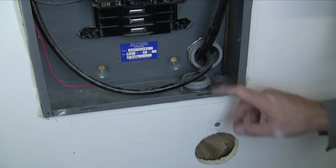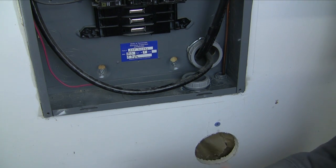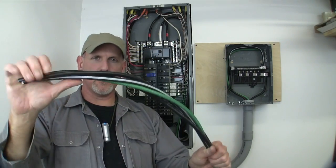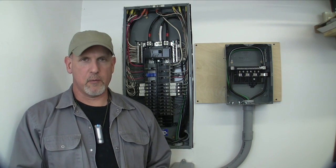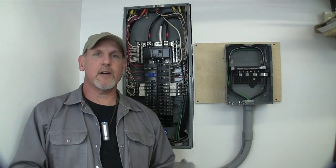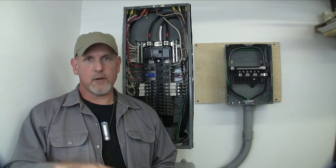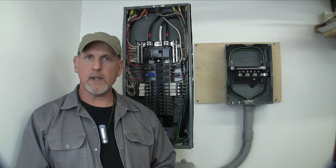So that's what we end up with. I'm going to attach this box to the wall, start pulling the rest of the conduit, get everything situated, and we'll be ready to pull the wire. Now the wire I'm using for this sub-panel is number two aluminum wire — and just hush, I don't want to hear it. People use aluminum wire all the time to put in sub-panels. Aluminum wire is what's running from the street to this service entrance, and I've talked to my electrical inspector about it — in fact, this is what he recommended. You can use aluminum wire for this application but you do have to take some precautions, and I'll explain that in just a minute.